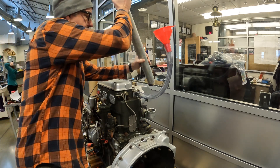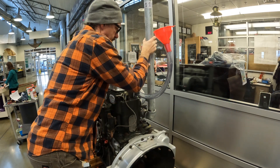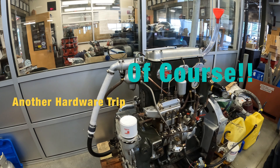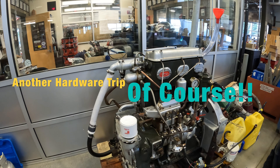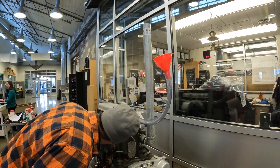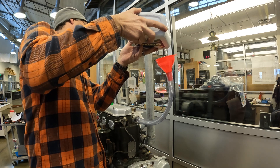The cooling system was easy — we didn't get much footage of it. The original centrifugal pump is on the far side, with a bent-up piece of copper pipe. It was set up for a keel cooler, so we just had to adapt from one inch to inch-and-a-half up by the thermostat. We made a little bypass loop, made a trip to the hardware store, then put a piece of clear hose as a header tank, plugged the other end, and dumped in some antifreeze to get a little protection on the engine. That's all we needed to provide cooling for running it on the stand.